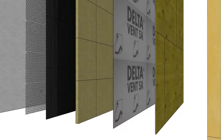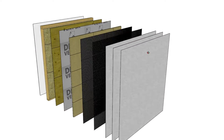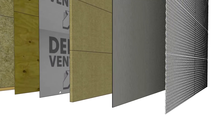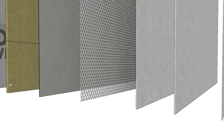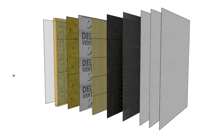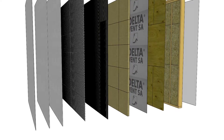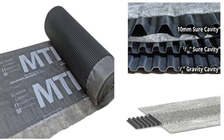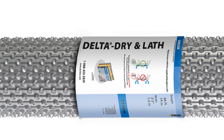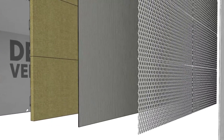With this in mind, we need to make sure that the wall details we're using provide a well-needed drainage point. On the exterior sheathing, I would recommend using a self-adhered, vapor-permeable membrane like Delta Vent SA. This will not only provide the weather barrier, but also a highly effective air barrier. On top of this, install a few inches of Rockwool Comfort Board insulation — a vapor-permeable, hydrophobic rigid insulation that will prevent water from condensing on the backside of the sheathing and improve the thermal resistance of the wall assembly. On top of this, install a double-sided drainage plane for stucco applications, such as the Sure-Cavity Drainage Plane from MTI or Delta Dry from Delta. On the side where the stucco will be installed, there will be a layer of fabric to prevent the stucco from clogging the micro-cavities. Over this, install a typical metal lath and then a three-coat stucco.